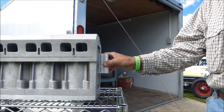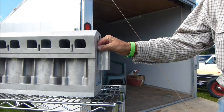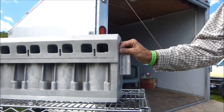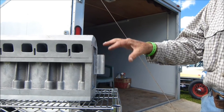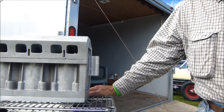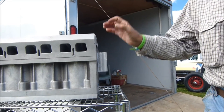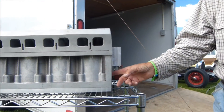And if it wasn't cast open — if it was cast closed — that wall thickness would have to be a quarter inch, which would restrict my water flow here. But I can weld in an eighth of an inch plate. And if you add the square inches times a hundred and twenty-five thousandths of clearance, you've got the equivalent of a five-eighths inch hole for water to go around. And that's on top of these grooves.